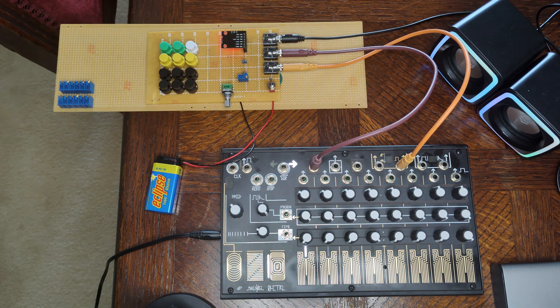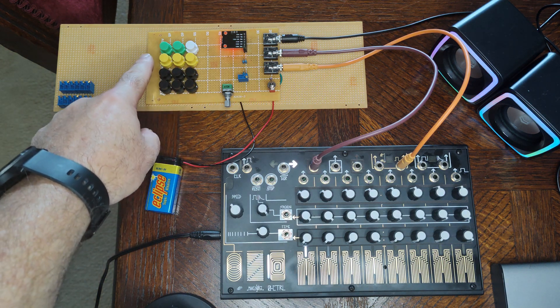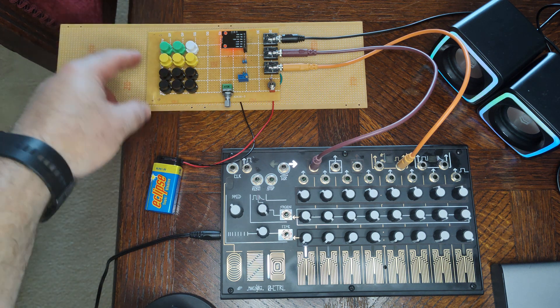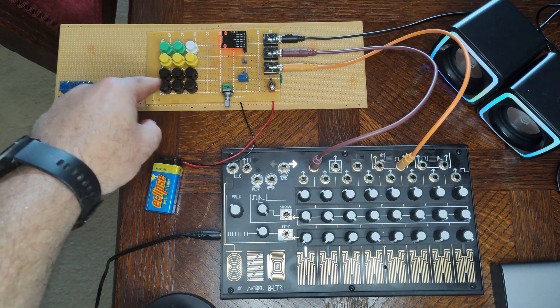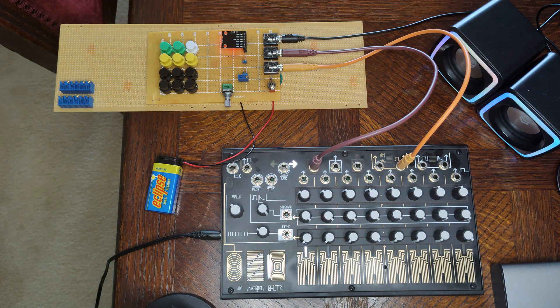This is an additive synthesizer, so it uses six harmonics. Eventually the buttons are going to be one for each harmonic. Each will have a value, a phase, a preset, and an envelope — there's an attack, decay, and a type: does it hold, does it come straight back down, etc. Additive doesn't need a filter, because you can control the harmonics directly and bring them up and down, emulating pretty much any type of filter — band pass, notch, low, high, whatever you want.